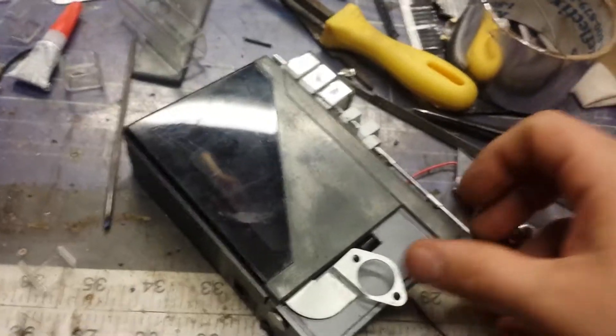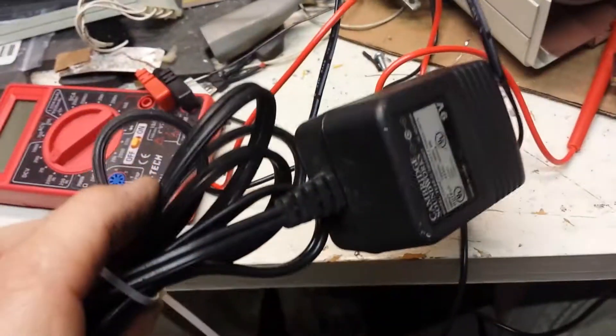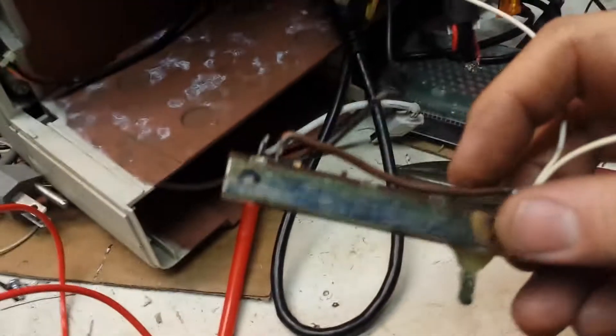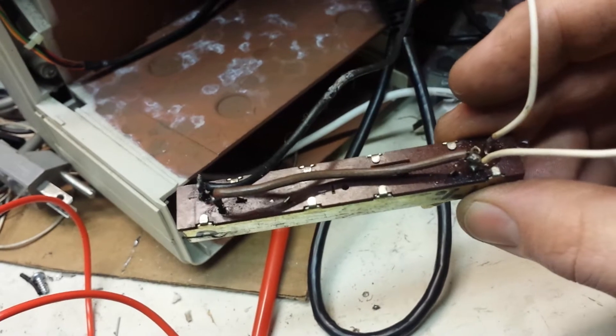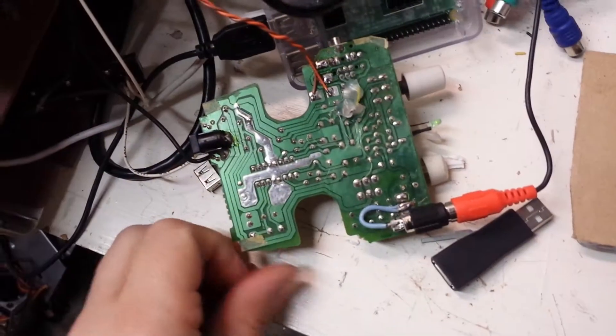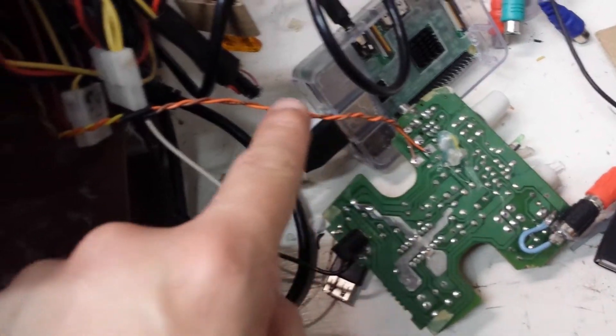I've put on an eject. So right now, what I'm trying to do is hook an amplifier into the computer so that I'll have sound. This is the amplifier out of an old set of computer speakers. It uses a 9V power supply. This old computer power supply outputs 12V and 5V. This is a variable resistor — I have wired it up so that it is now acting like a voltage divider, and I've already set the slider to where it creates just about exactly 9V. This was a cheap amplifier to start with, but it's all rigged up. I've got the speaker wire running through here and then going in here to this speaker right there.